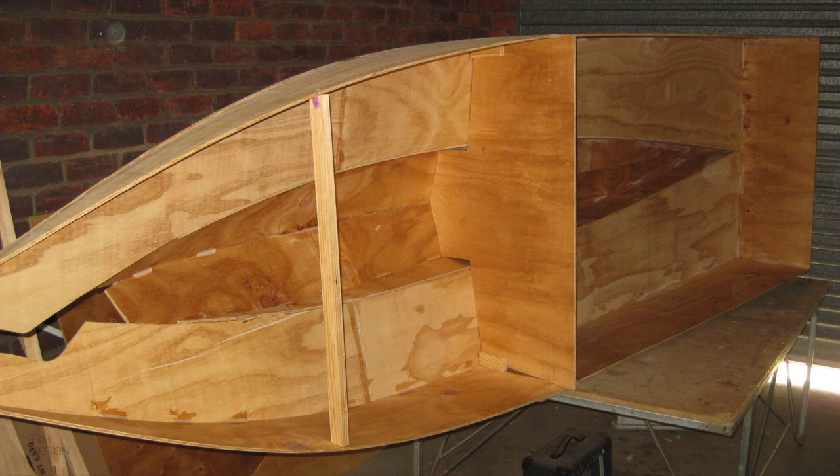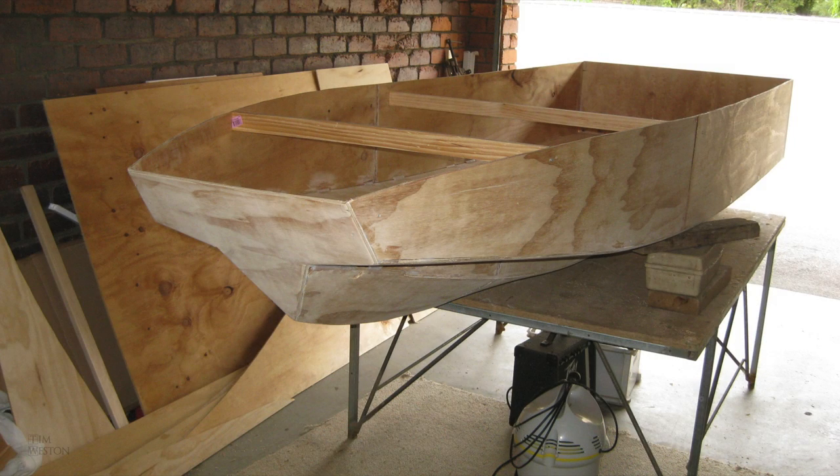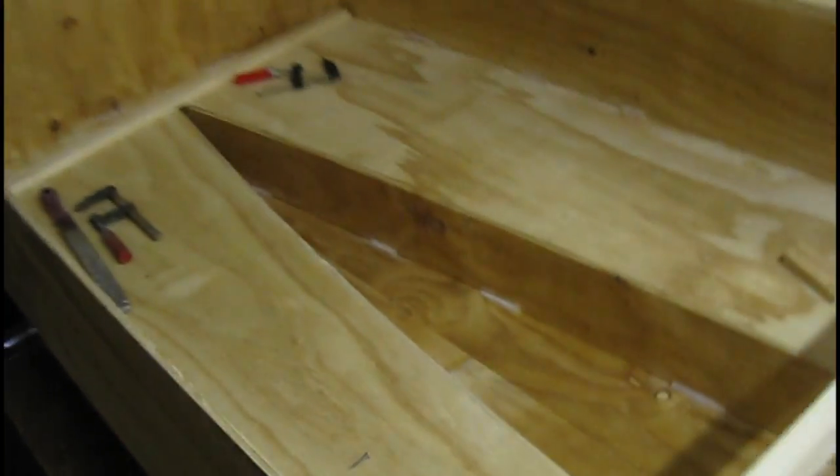The whole boat is glued together and finally coated with epoxy resin. It's all done with epoxy. Epoxy resin with a filler to thicken it is used to stitch and glue the wood together in the beginning. It's almost like spot welding in metal. Once the glue dries, you can take out the screws.